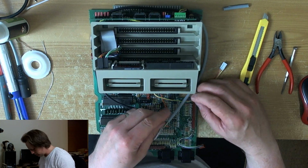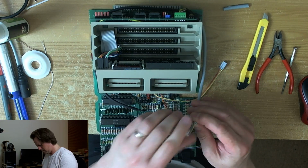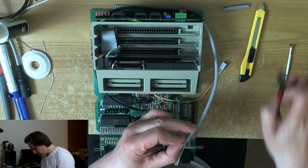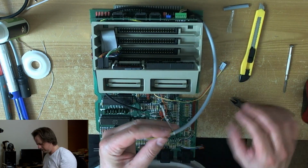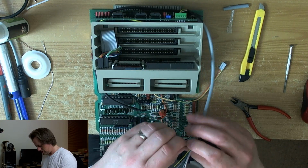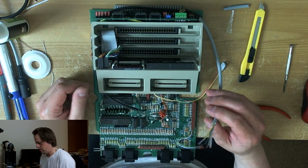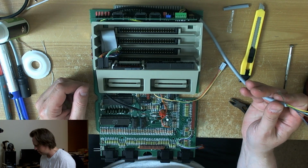This took a lot longer than I thought. Right, so that's the shield, which is more or less redundant because it's never going to make it as far as the jack, and the jack has ground connected to shield anyway. So I checked that out with Jürgen. He says it doesn't make any difference. Should I short the shield and ground at this end, or should I just snip the shield off?